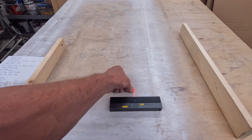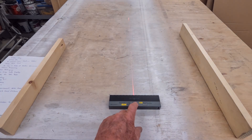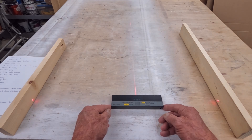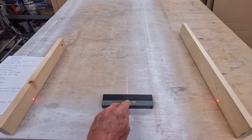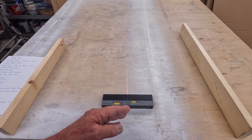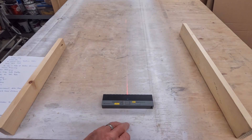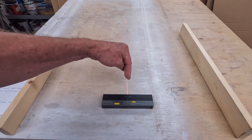When I push the button to ready it for a measurement, it tells me where center is — which is really cool. It's telling me I need to slide it this way a little bit. Right there is half — it's happy with that. I press it again and it locks into place so I'm exactly in the center, and it gives me my measurements between the two surfaces.